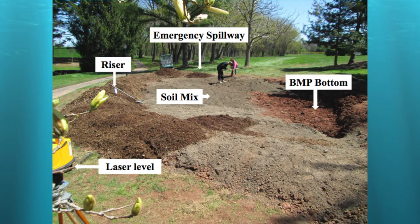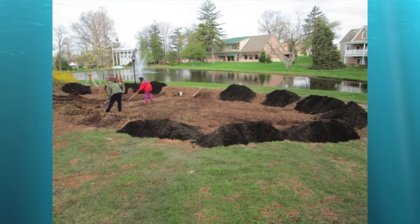Here's a picture of it during construction. The BMP bottom is flat — we excavated this side first and flipped those soils over to make the berm. It's important to keep equipment out of the bottom of the BMP to avoid compacting the soils. The excavator was sitting off to the side using the arm to stay out, dropping soils, and backing out without getting into the bottom. We also used the teeth on the bucket to scarify the soils on the bottom to break up any compaction. This is the soil mix we picked — a very sandy mix with some compost — and we used a lot of mulch on top.